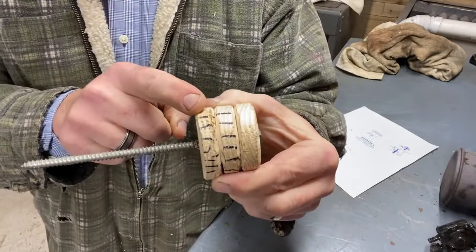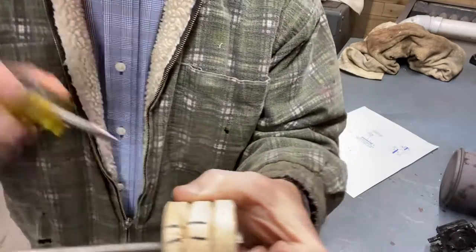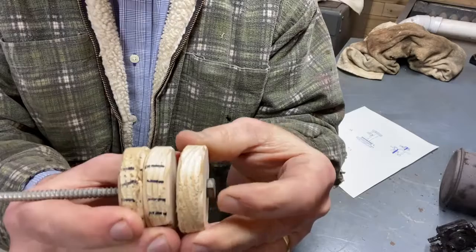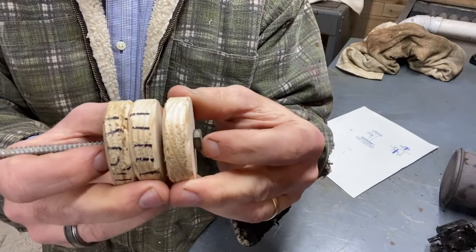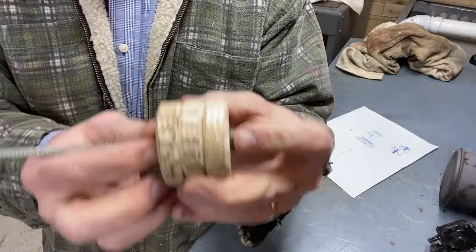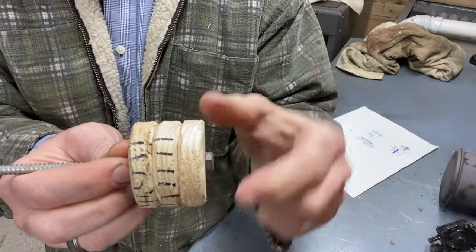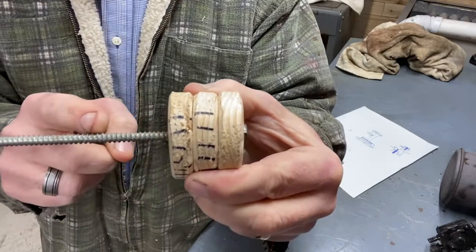The next thing to solve that mystery: between these two gears right here is a clutch. Imagine that gap is filled with about an eighth-inch, rubberish brake-pad-type material, and these are all squished together, locking it in place. That's one important thing to know — there's a clutch material in there. That's where our problem is; that's probably all seized up.